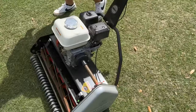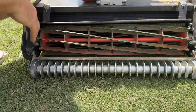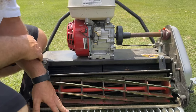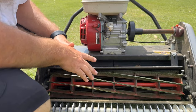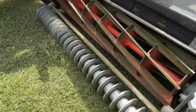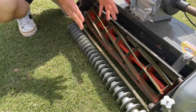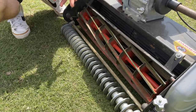This is a nine-blade on the 25 with the Honda engine and rib roller. This is the old style rib roller — they've got a new version coming with all the mowers. The reel doesn't kick on until about 1800 RPMs. The drive does not work until the reel is spinning, but you can use the mower without the drive. You can push it if you needed to, like if you got into a spot that was kind of tight and you didn't want to use the drive.